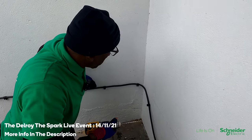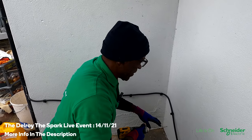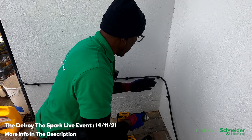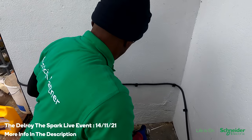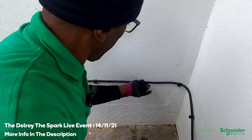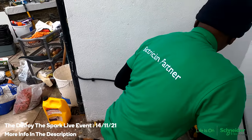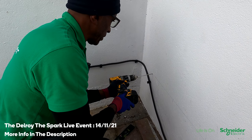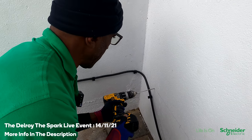In the regs book, I think they've got a certain distance you're supposed to have cleats. The way I do it, I clip it to make sure there's no great sags. Marley put one there and one there, but to me that was moving in the middle, so I just put an extra one there. Probably that's how he's been taught on the old building site — not by me. When I looked at it I thought, that doesn't look right, so I'll put extra ones in the middle.